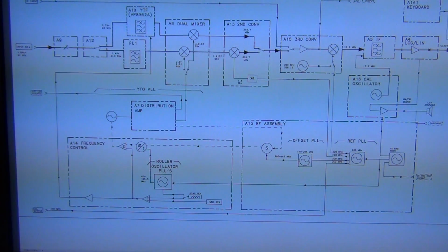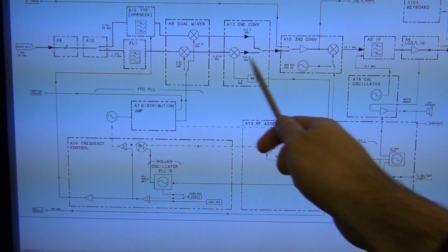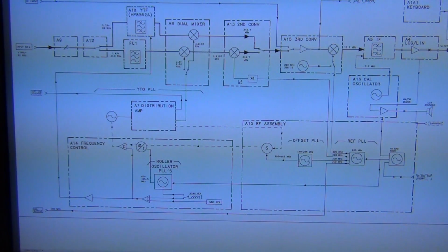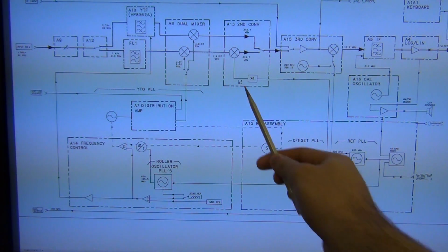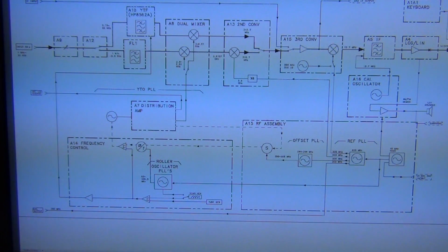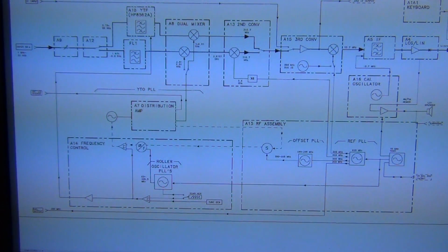So what I'm going to do next is a quick search on eBay, just out of curiosity, to see if I can find a replacement part for these. Because if I can, that would be easy. We'll just change the modules, because these things aren't really repairable. They're not quite monolithic, but hand assembled individual components, die and wire bonded, old technology, so you can't really repair them. So let's see if I can get a replacement component.